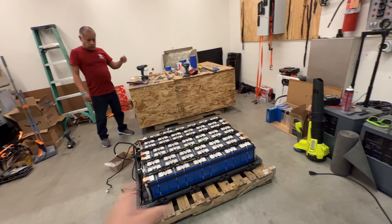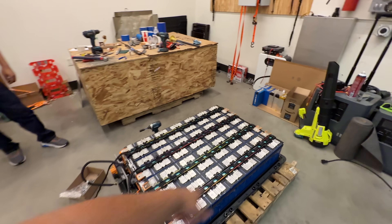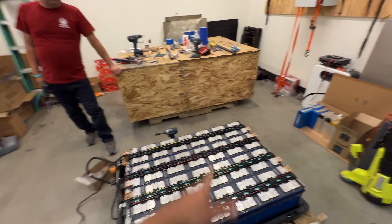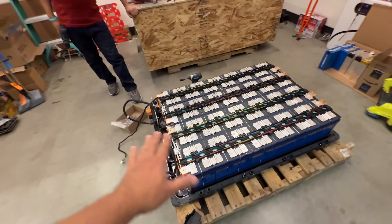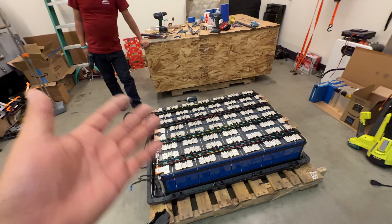Someone mentioned that some inverters can handle a 13S configuration, which is around 43 volts. If you can do that, you literally don't have to modify anything — just use four 13S strings, bring them to the panel here, and connect to your inverter. That's probably the easiest way. If you want 48V, I have another video on that: you go 13S then add three more cells, repeat that for three sets with a few extra cells. Use a cutting wheel, but be careful — put pads in to avoid shorts, and blow away metal shavings from drilling.